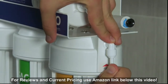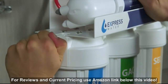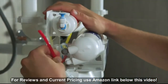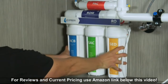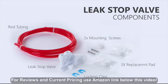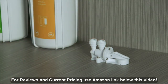Push the white tubing into the elbow. Next, screw a male elbow into the left side of the system and twist until the elbow is tight and faces upward at an 11 o'clock angle. Push the red tubing into the elbow. Place your system in its permanent location. Position the leak stop valve beside the system on the cabinet floor and use the screws to secure it in place.